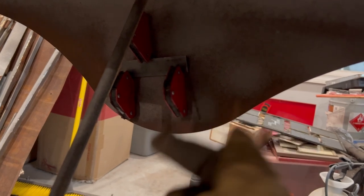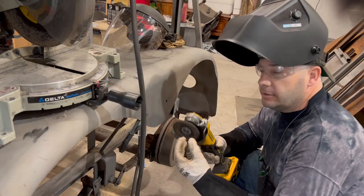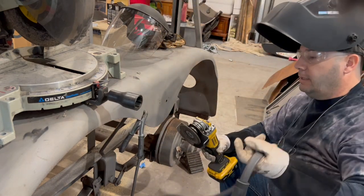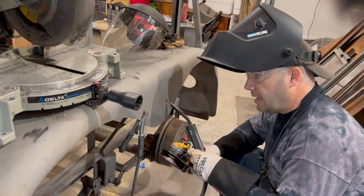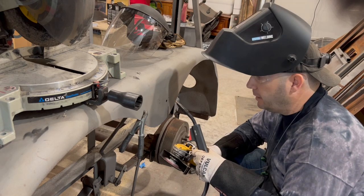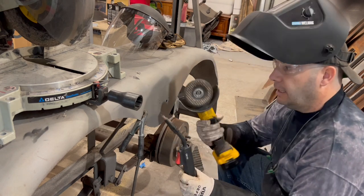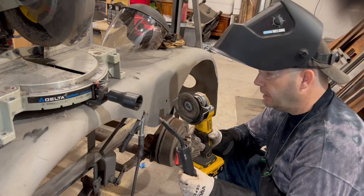Here's what it looks like — I've got my four-inch piece of one-inch steel with the magnets placed to hold it in place. Once the weld is in place on the other side, I can take these magnets off once it's tacked in because it's not going to move. I've got my grounding here, I've got my wire welder, and I've got that backed on there with that one-inch flat bar. I'm going to fill in these holes and then grind it smooth with my angle grinder with the grinding wheel.